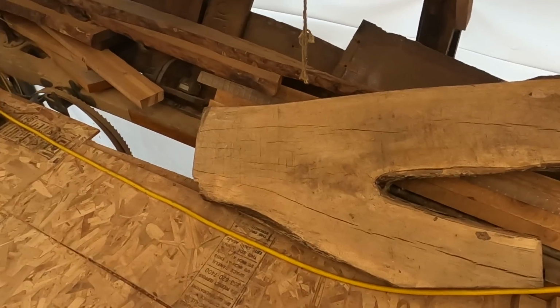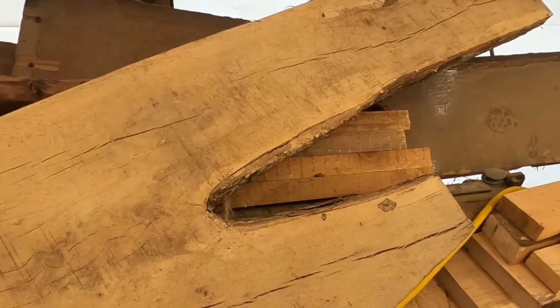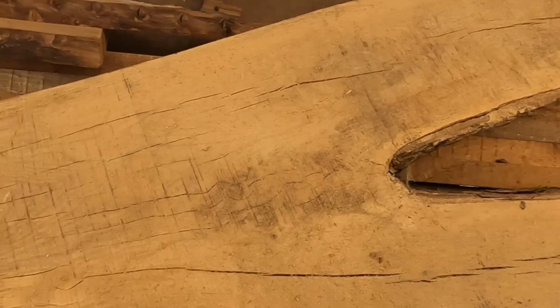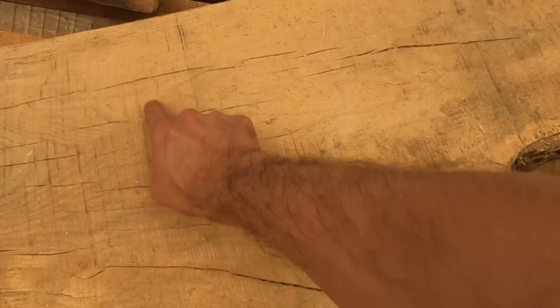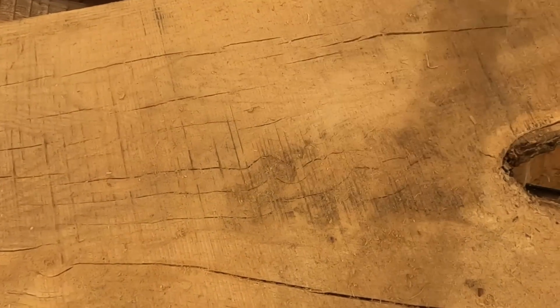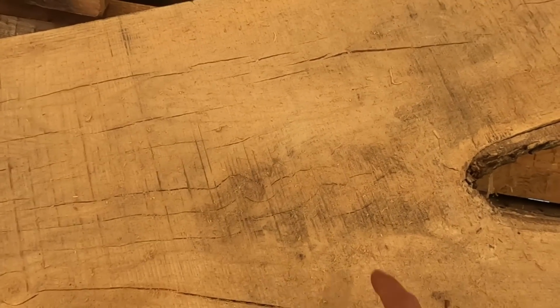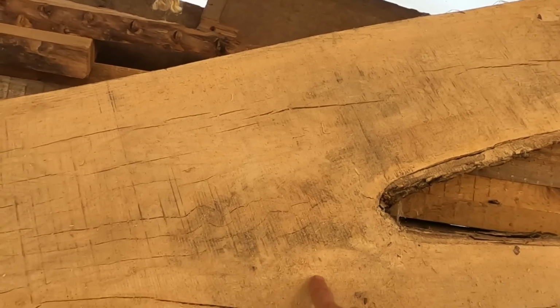So I think for the center block, right up against the stem, this big crotch of white oak will work. I think I can cut a block right out of here, and that'll go up against the stem, and the wings will come off either side of it, and that is all twisted and interlocked grain. So I think that'll work well.